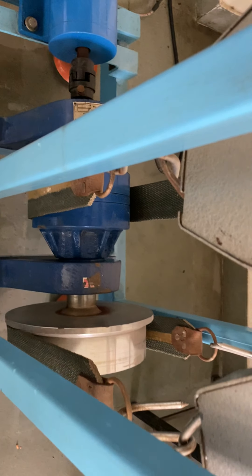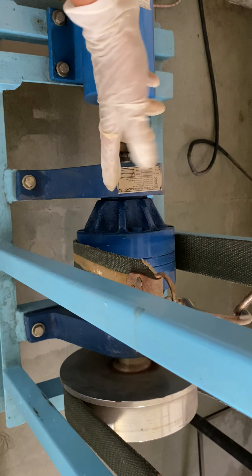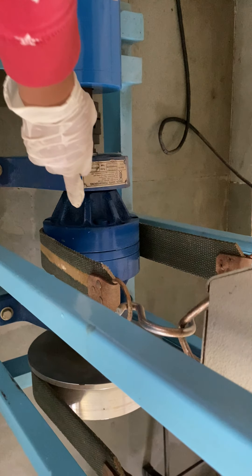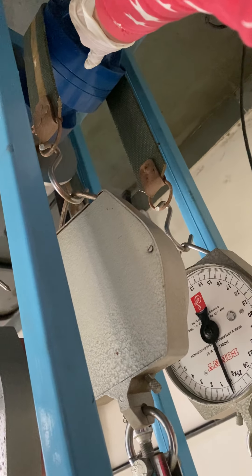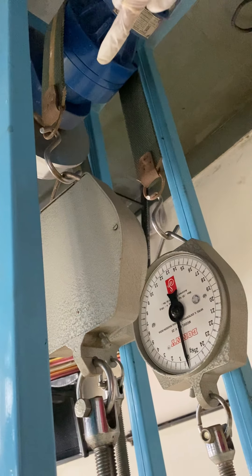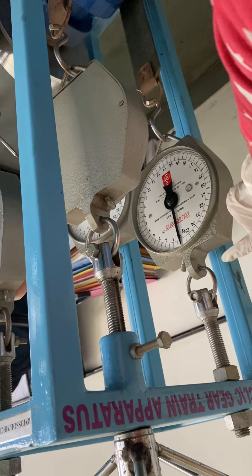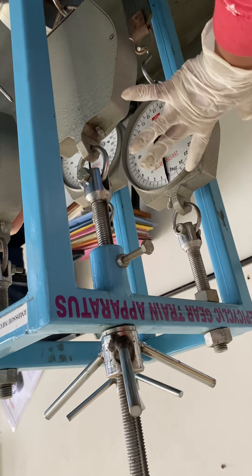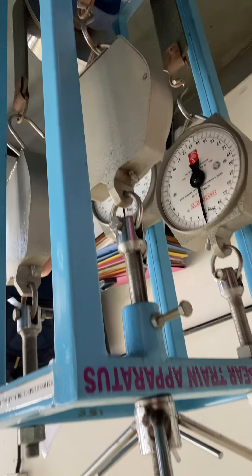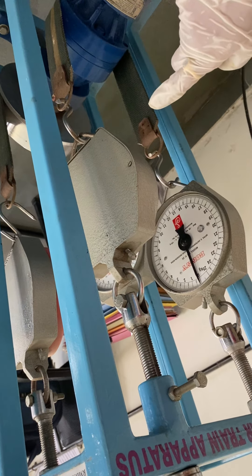Here this dynamometer is provided. When the motor starts running, the epicyclic gear train will start rotating. We have to hold the epicyclic gear train part, and to hold it, we need to determine how much torque is required. For that calculation, we require the mass applied on the external surface of this epicyclic gear train. The rotating torque will get stopped while considering the reading. With the help of this dynamometer, we are going to note down two masses: M1 and M2. Whatever the net mass applied on this epicyclic gear train will stop it from rotating — you have to take care of that while noting the readings.